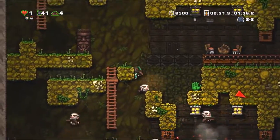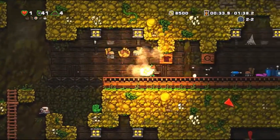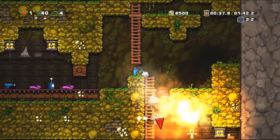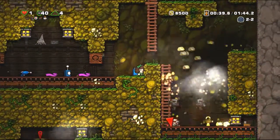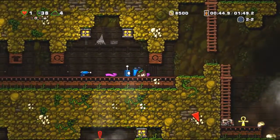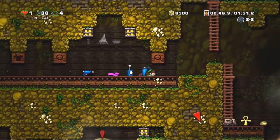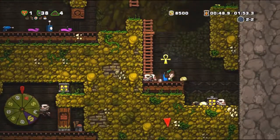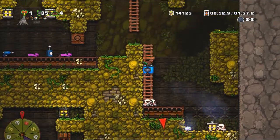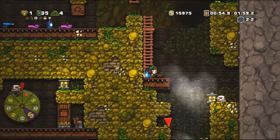After these came out of the planer, I sanded everything smooth including the corners because they were pretty sharp. Now I'm going to finish them — I'm going to use a couple of coats of wipe-on poly. Then it's time to make the brackets to go on the outside of these.